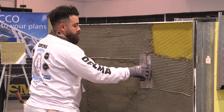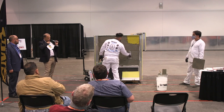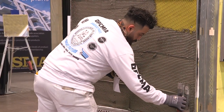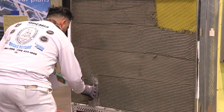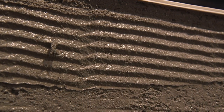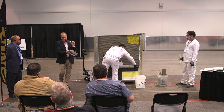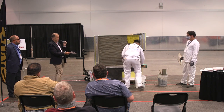There are a couple of purposes for those serrated edges. One is to make a key for the next coat, because this is only half of your base coat — a nominal 3/8 inch thickness — and you're going to put on another 3/8 inch thickness, so you want something to bond to. The other reason we like horizontal lines — and the ASTM says predominantly horizontal, it doesn't mean every line has to be — is that if you want to damp-cure this wall, when you hit it with water, it helps slow down the water process and helps the cement cure a little bit better.